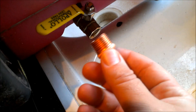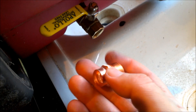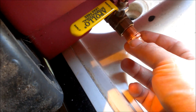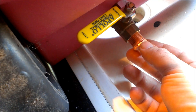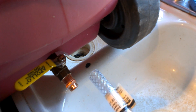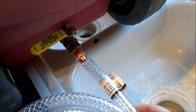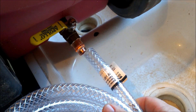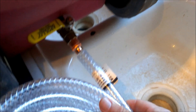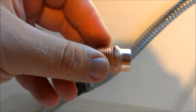On the outside I have a piece which is a half-inch threaded male, and on the other side standard copper female. I'm going to put some Teflon tape on this and screw it in, then attach the plastic tubing — standard plastic tubing from the hardware store, 5/8-inch diameter on the inside and 7/8-inch on the outside. I got 10 feet of it to run from my mash tun down to my boil pot.